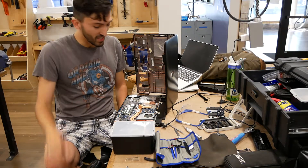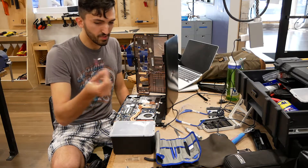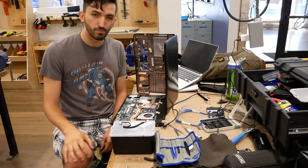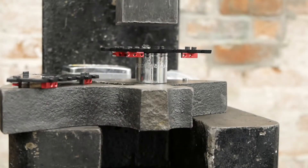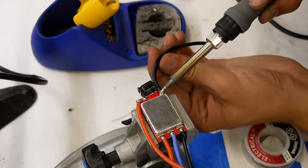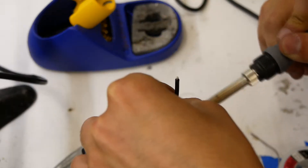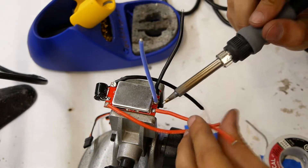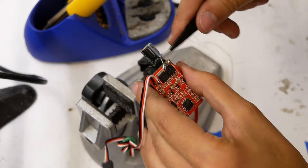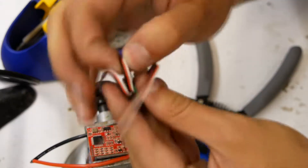It's the Sunday before the competition, and what I didn't want to be doing today was fixing my laptop which won't charge. I think I've found the root cause, so I'm going to re-solder this connector and put my laptop back together so I can start assembling the robot again — I need to get my designs off it because I need to remake some parts that don't quite fit together. Now we're press-fitting in all the bearings, then modifying the speed controller by removing the battery cables and putting them in the opposite direction for routing inside the robot. Then taking all of the motor connectors and changing them to stick out at 90 degrees due to the limited space, and re-soldering the capacitor to save a few more millimeters, going from a sideways orientation to up-and-down on one side of the board. Then redoing the RC servo leads to make them much shorter.